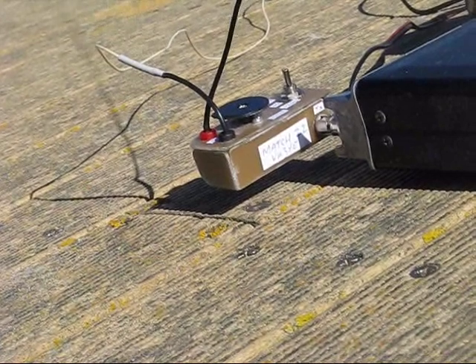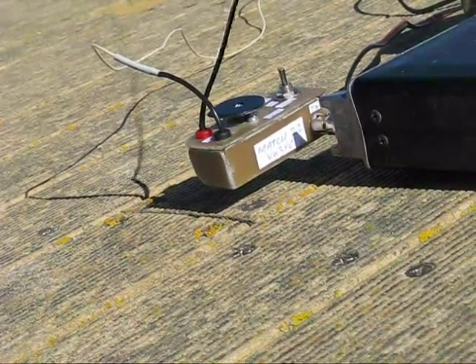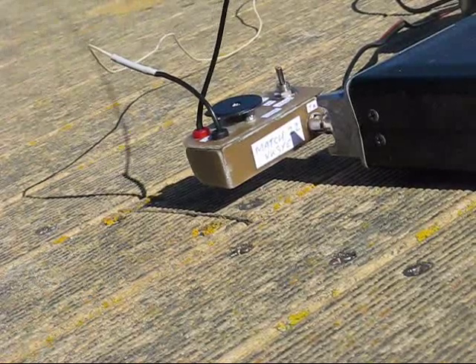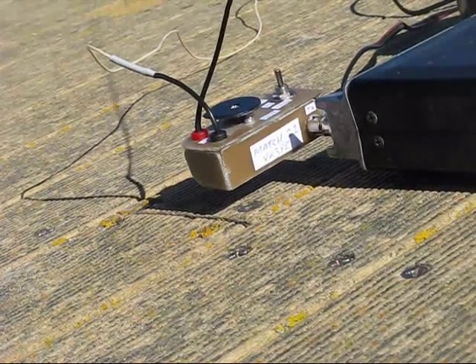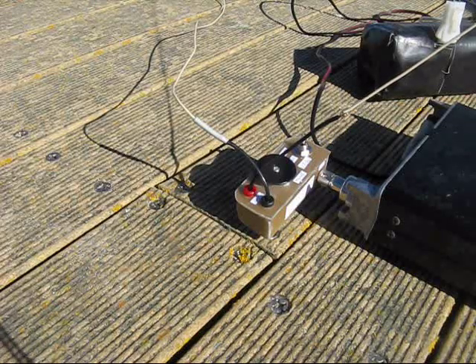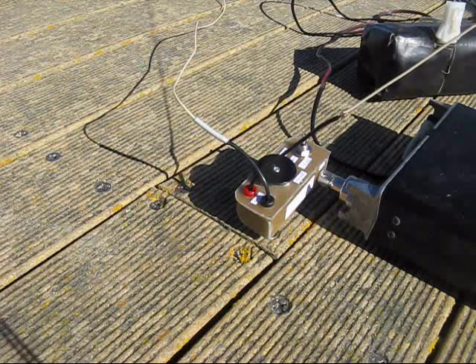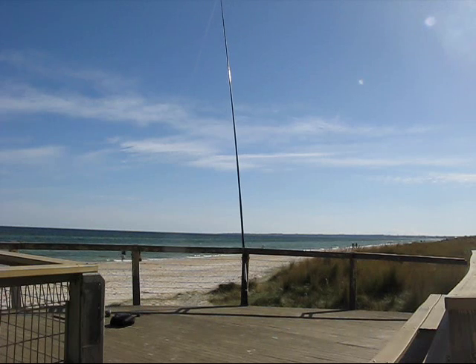A critical part of minimum QRP is an antenna matcher. An antenna matcher is smaller than coax feed line and allows operation on several bands with one wire. I call it the Match 22 because it operates with around 22 meters of wire. It offers a high impedance on 7 megahertz, so you don't need to worry much about an earth radial.